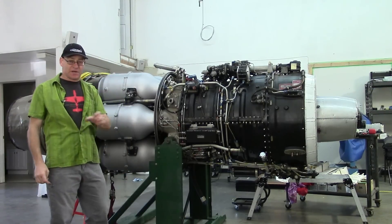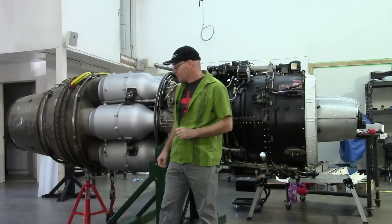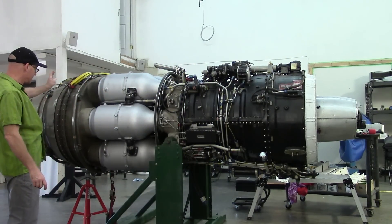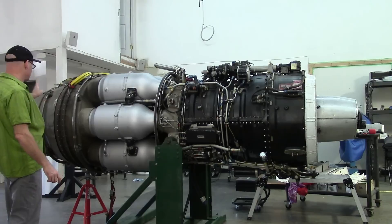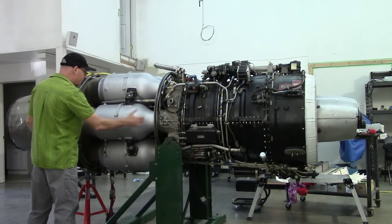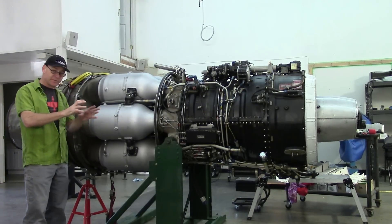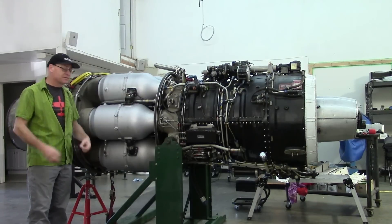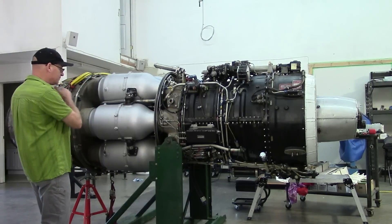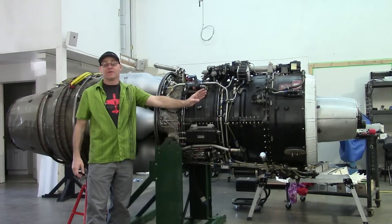What we did find is, as you remember, from about the firewall back, we essentially rebuilt the back end of the engine. We had to replace the turbine nozzles and turbine blades. In order to do that, we had to take the entire engine all the way apart from the firewall back, and then we put it all back together. We did a little bit of refinishing and refurbishing, some repainting, some cleaning, some replacements of consumable parts. Basically from here back, it's perfect. From here forward, we didn't touch anything.